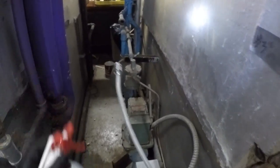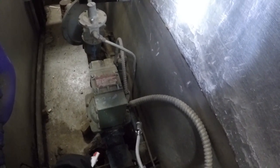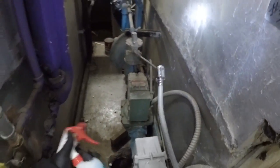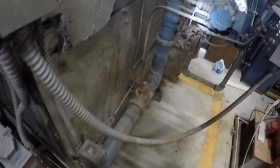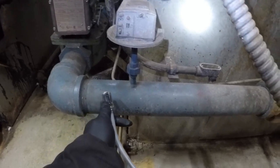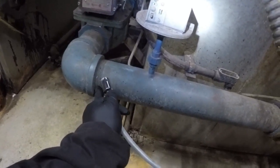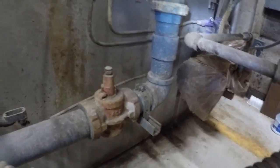We'll need to be in operation for anything past the valves. And if we did get a hit, that's when we're going to come in with our bubbles — micro leak detect bubbles. You don't want to use Dawn or anything; it will hurt the metal. You don't want to be dragging the detector around; you want to be about an eighth of an inch or so away from anything. You can do that with your hand. So I'll go ahead and start operation on this thing and go through the rest of it.